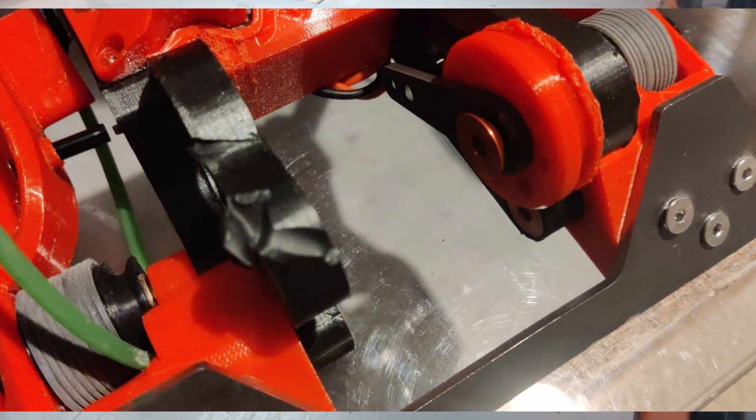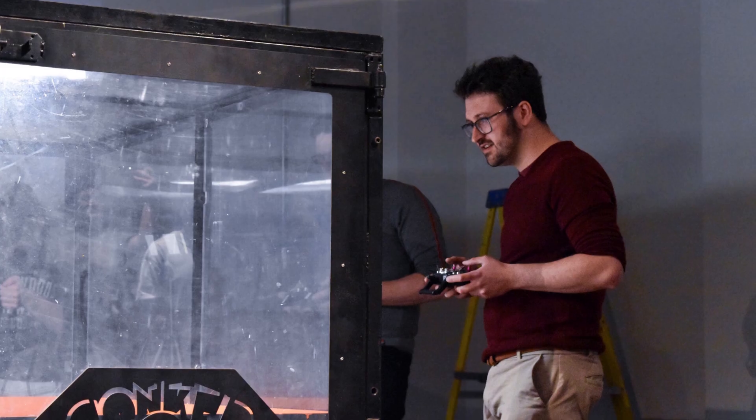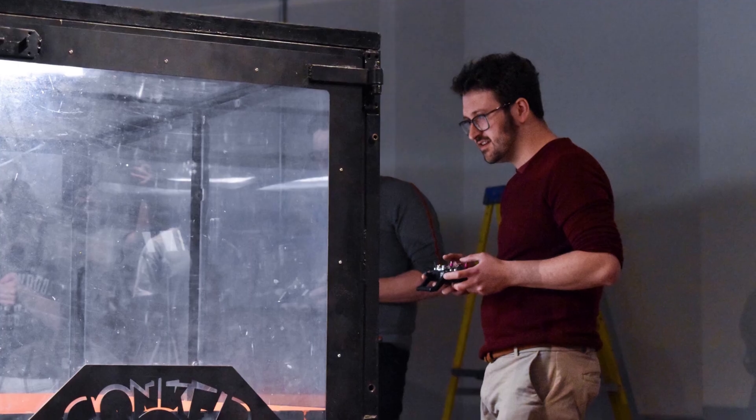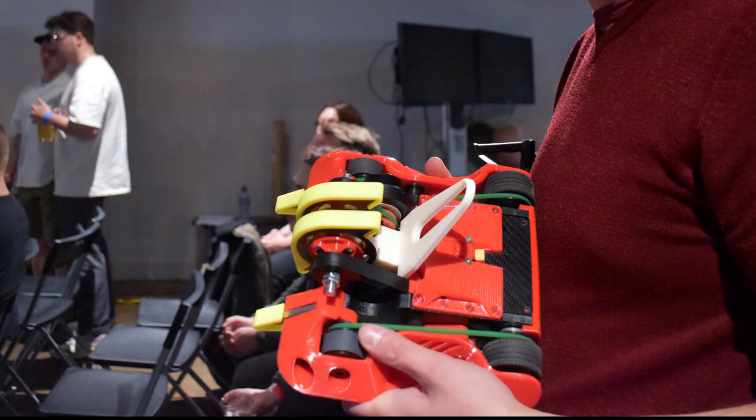The robot took a few good hits before ultimately being disabled as one of the rear wheels was ripped off, and it landed on it when it came back down from the roof. Interesting damage included how badly the 3mm thick hardox wedge got bent, and one of the side armour retention bolts was ripped clean out — with the nut still on the end, ripping a chunk of chassis out with it. All in all it was a fun day out. The robot hadn't done what I'd wanted, but I'd managed my maiden win at beetle weight and learned heaps for a future revision.